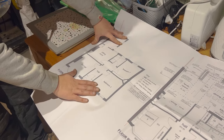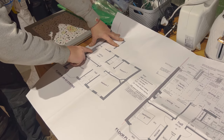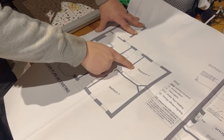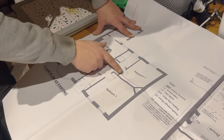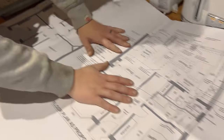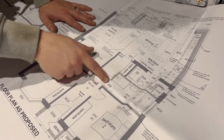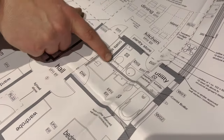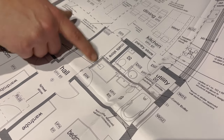The wall that's coming out is here - there is a timber sat on this chimney, the span from here sits on this wall, runs across the top and just protrudes through. I need to knock this wall out and I need a steel from here across to here, and that will take the end of the timber. Then eventually, as you can see in the drawing, the stud wall runs through in line with the existing wall, and there'll be a steel sat on that wall across here supporting the attic timber with the stud work as well.